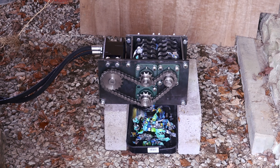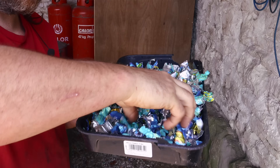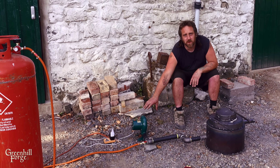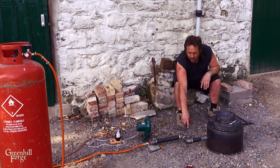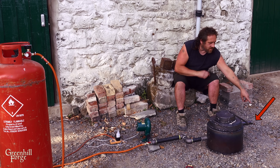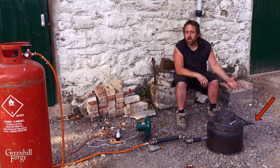This is part two in my series of melting down aluminum cans and recasting them into blocks of aluminum that I can then machine out into parts. In this kiln it's a forced air fan system. I can adjust the speed and flow of the fan. Propane comes in here to mix for an air and propane mixture. They enter at a stainless steel burner, swirl through the kiln, and exit out the exhaust. I can use the exhaust pipe to preheat things like molds I'm going to pour into.